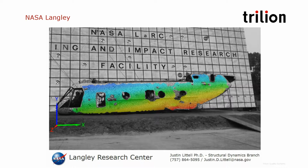that are used to calibrate our sensor. The other thing that we can notice that's interesting is the size of the speckled pattern on the surface of the object. In this case, we have such a large field of view that the speckled pattern cannot be applied with spray paint or stamps. These were individually marked dots on the surface of the object.